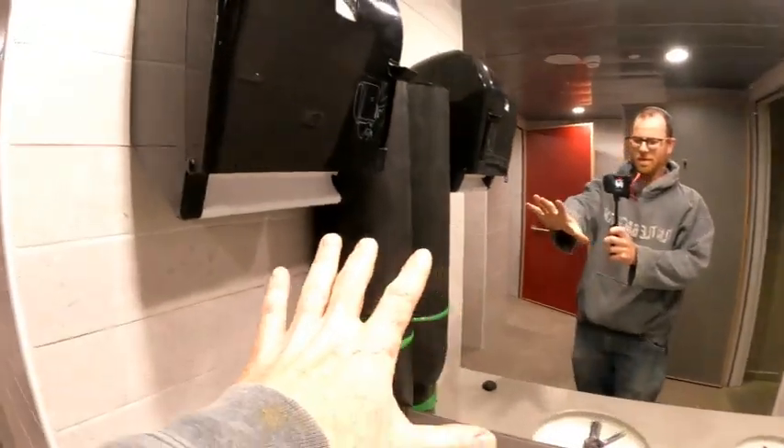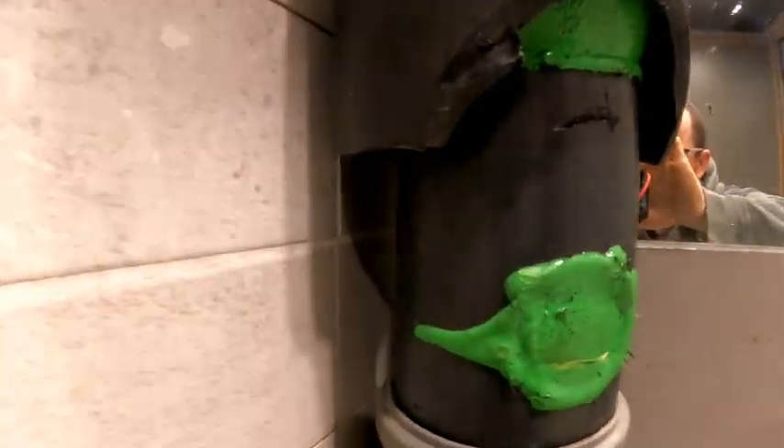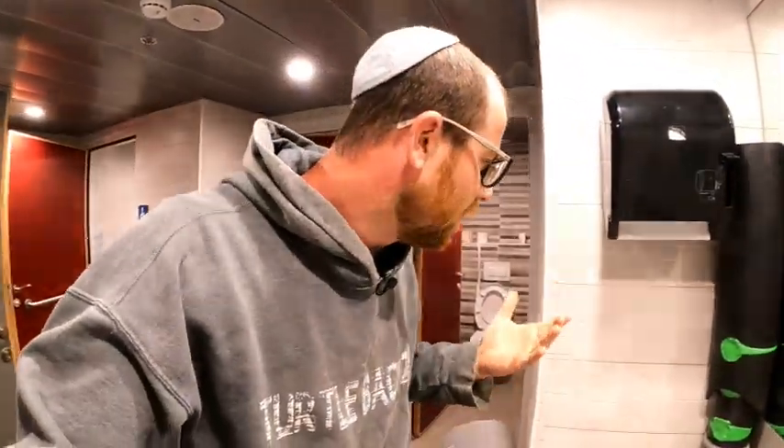I filled this up with water — you can see the water level right there — and I'm looking for any water coming out of the transition area or anywhere else. Everything is bone dry. Absolutely bone dry. So with proper saturation of the liner, we did the patch correctly and it is definitely waterproof — hermetically sealed when done properly. I'll repeat the test tomorrow and leave it outside for about an hour just to double-check. When you impregnate properly and wait the proper cure time, everything should be golden. I hope you found this video helpful — give it a thumbs up, subscribe to the channel, and see you next time!